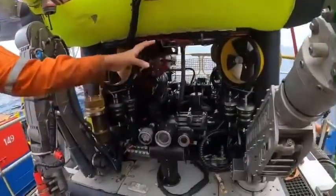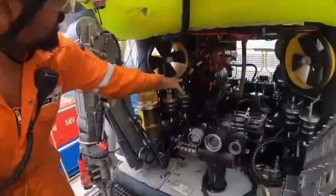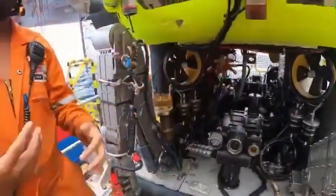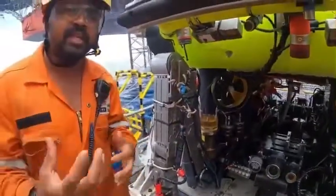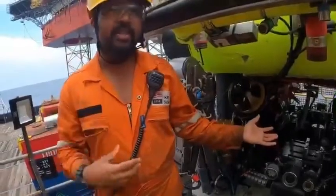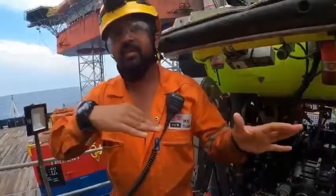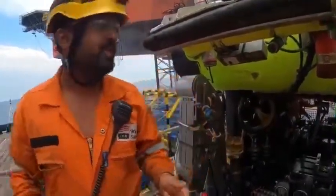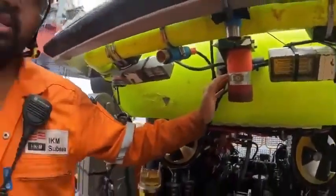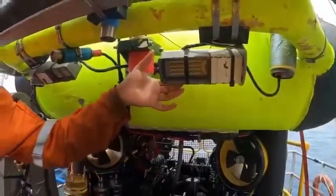The thrusters are electrical thrusters — each thruster has one electrical motor. That is the fiber optic gyro I was talking about. That gyro is our reference in the water to show us the heading. We use fiber optic gyro so that when we are near any metal object, the reading doesn't deviate, compared to a conventional gyro. This is the Imagenex sonar that we're using. And these are the LED lights. There's also a survey beacon — another reference that we have.